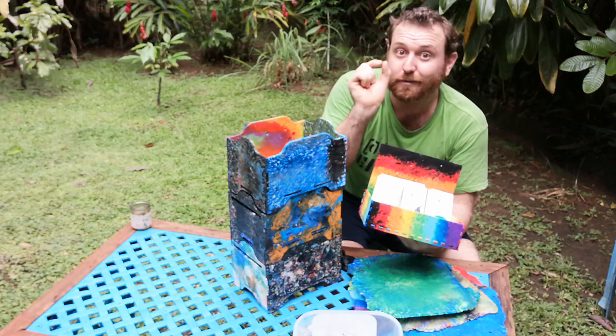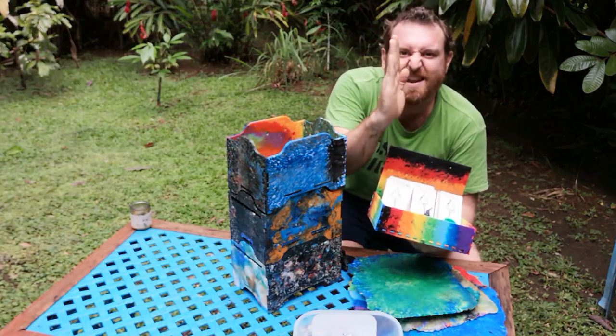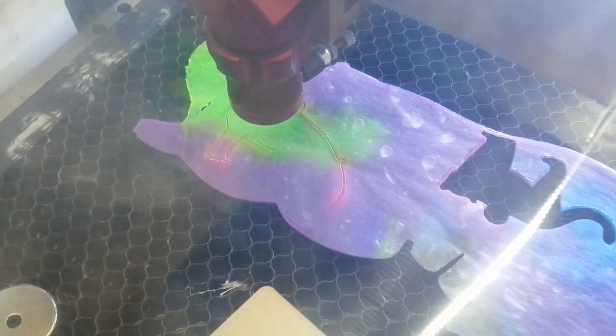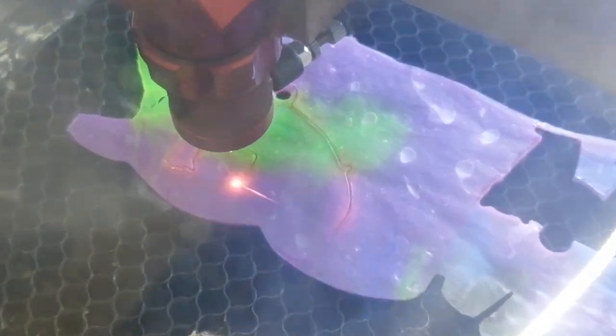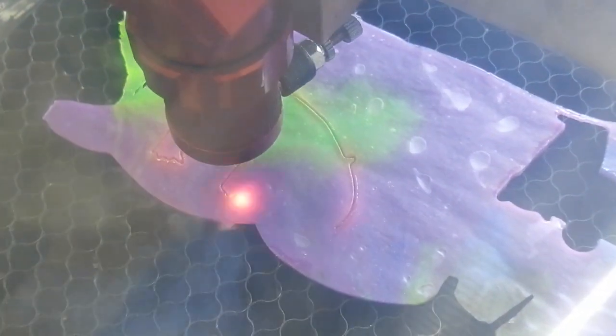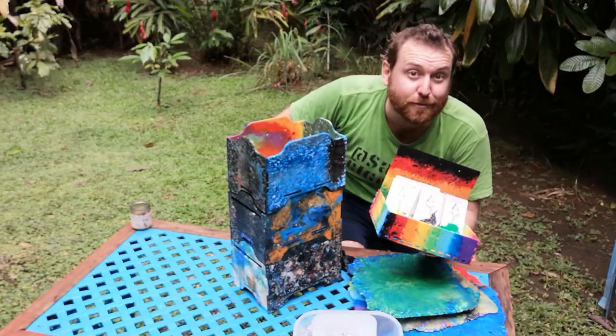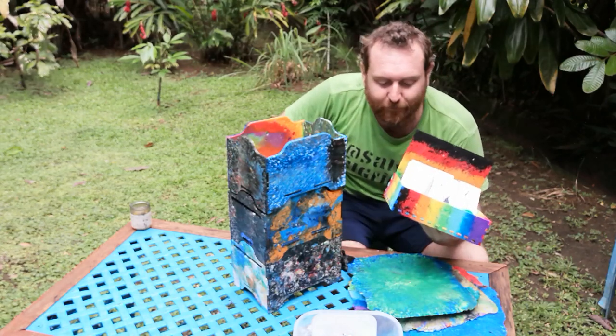So if you have a really good laser cutter and really good material, you can have a very narrow kerf. When you're melting this plastic, PLA has a pretty big kerf because it soaks up a lot of heat — it kind of spreads out, it can be kind of thick. So maybe a 0.15 to 0.2 kerf is something you can aim for.